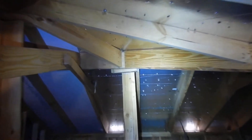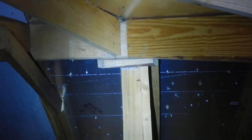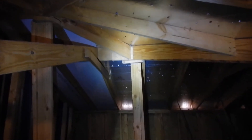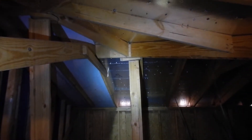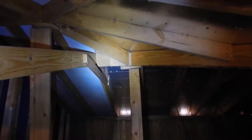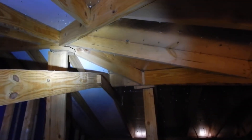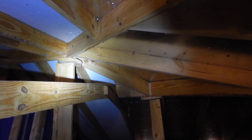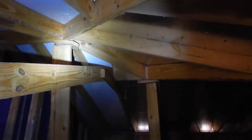I have abandonment issues. See that right there? That's called palm bracing. A lot of home inspectors get all upset when they see palm bracing. The code doesn't say it. Palm bracing is a common building practice with mass production builders — that way they don't have to measure so much, they just stick it up there. But the code doesn't say that palm bracing shouldn't be present, and it doesn't say that it should be present. The code is silent on palm bracing, as long as the load path is being transferred properly.